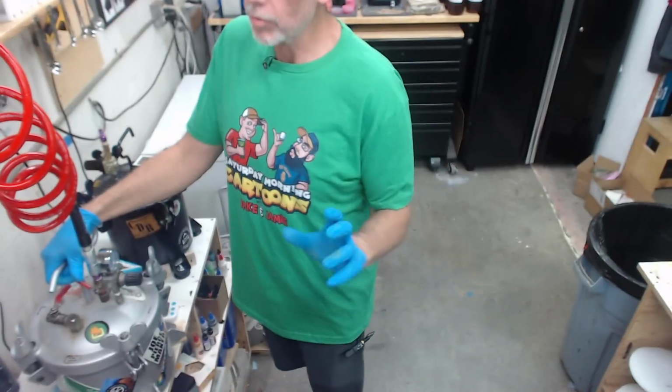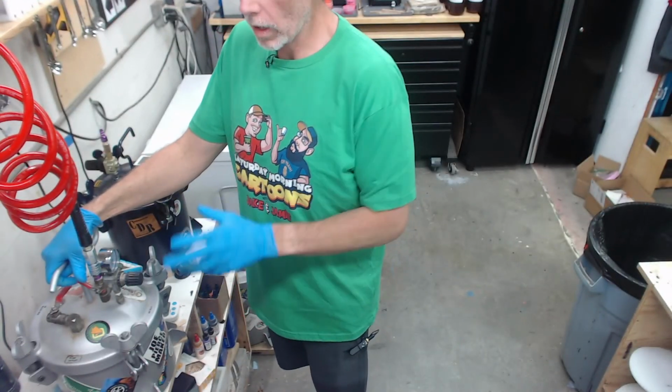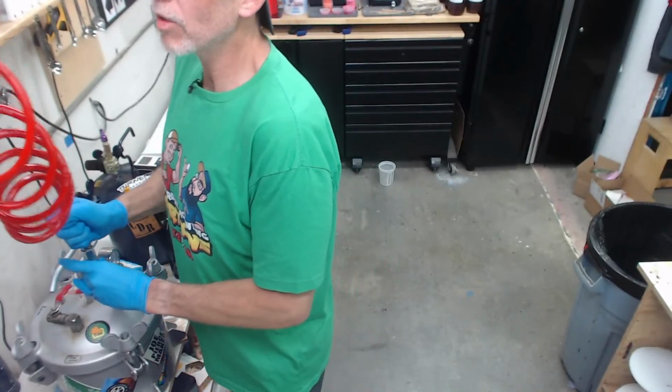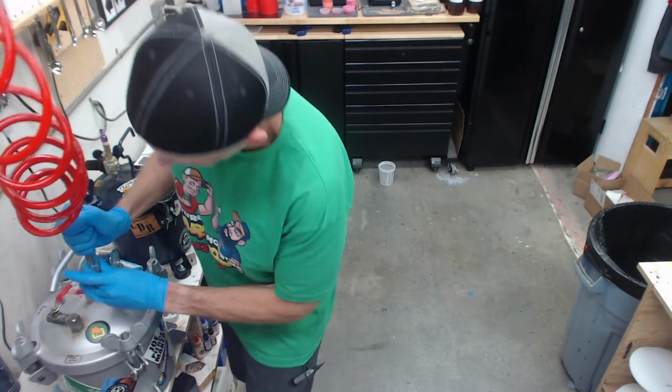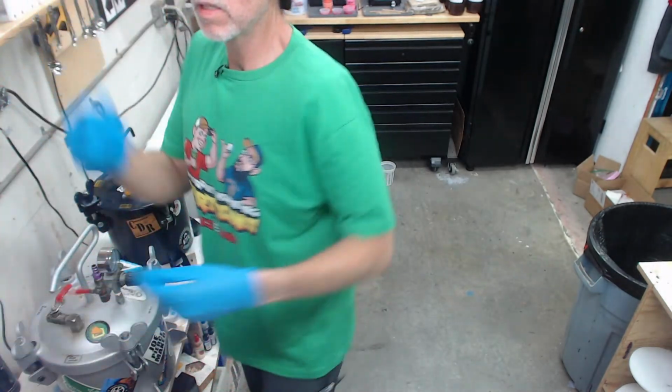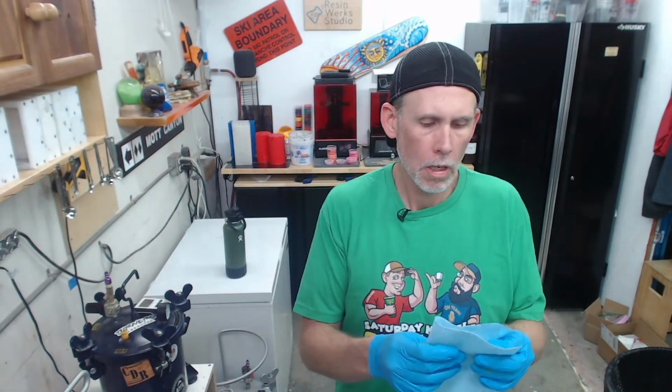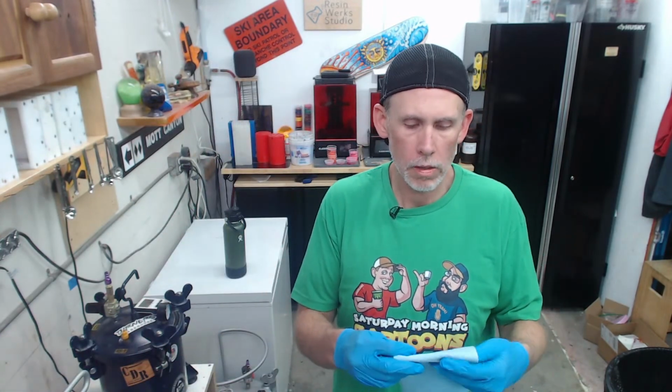The directions for Alumilite Clear Slow say 4 hours, I think, at this point. Typically, as long as it's reasonably warm in your shop, it's 75 degrees in my shop right now, that's plenty for a blank like a 1.5 inch thick blank like that, that's kind of tall. If you were doing one single pen blank, very thin, very small amounts of resin, you're going to easily want to leave it in for 4 hours.